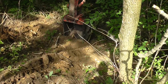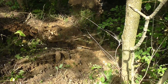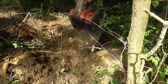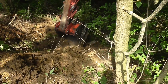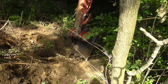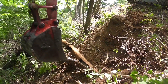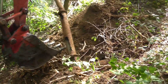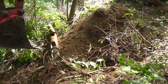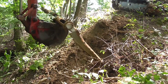The time has come — we got up to the hole going through the pond dike. Our plan was to dig from where it exited the dike, dig backwards and follow it back into the pond. It didn't take too long and I think we found the cause of the leak. We quickly found a metal pipe that was used for the exit, the overflow drain. You can see it's rotten. The water probably got out of that pipe, scoured around the pipe, and created a larger and larger hole over time. I was glad we found this.